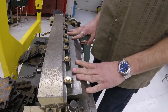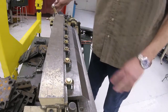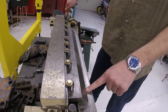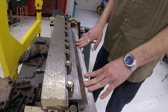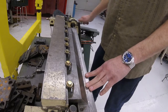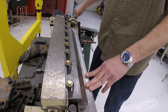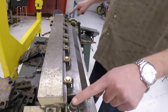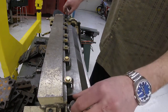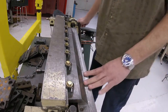It's very important that we make sure the fingers are set correctly. We've got another handle here and you can see these fingers moving. This is called our clamp handle — it clamps and holds our metal down. We want to make sure it's clamped nice and tight. If it doesn't clamp tight, if it doesn't feel very hard to clamp, we can tighten the clamping pressure with these two screws, one on each side. If I tighten those, it will make it harder to clamp and it will clamp tighter.